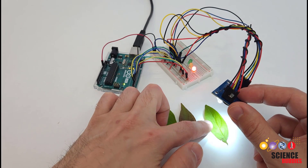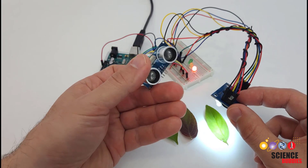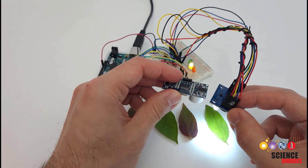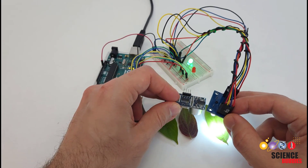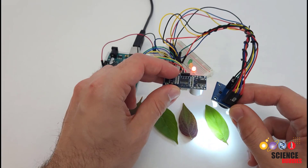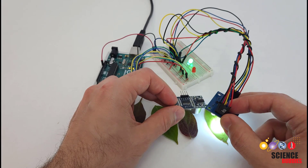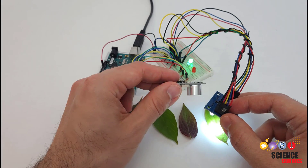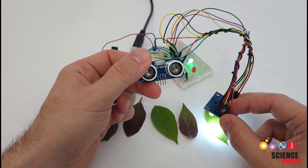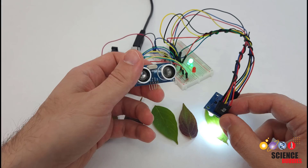You can see I'm over a green leaf here, but now it's actually detecting red because I'm too far away. So if you add an ultrasonic sensor into the mix, you can also measure how far you are from a surface. For example, if you have it mounted on a mobile robot or a robotic arm, you can move closer and make sure you are the appropriate distance away before you take your reading. We have a tutorial about how to use this ultrasonic sensor linked in our Arduino tutorial playlist, again in the description of this video.